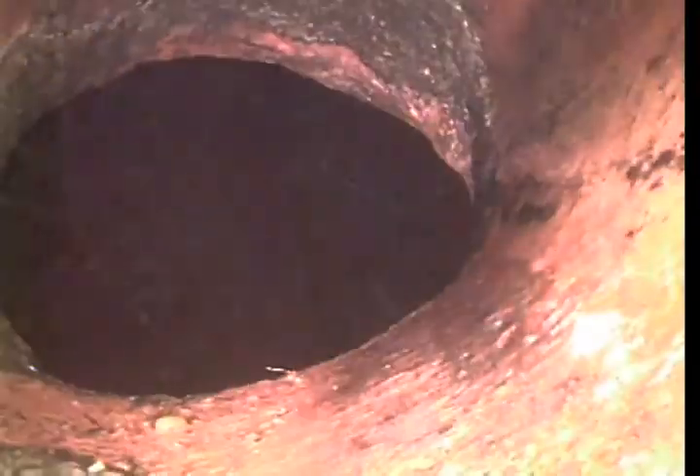Right here about the city sewer, six inch clay tile right here, and transition back. About 80 feet is the length of the line, and start pulling back. Right here is six inch white PVC. Water is on the top right hand corner now, transitioning up to the top of the screen, which is the bottom of the pipe. Now we're in a six inch clay tile right there.